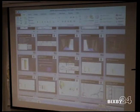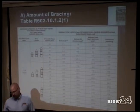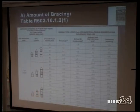But you know, on the second story, you are connecting your sill plate to the slab because you put 5 feet center to center J-bolts. And when you go to the top plate and build another floor on top of that, you are counting on the nails to transfer the shearing load and tension load to the first floor just by the nails. Yeah, there's supposed to be some.